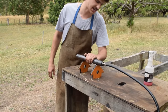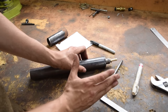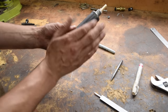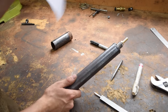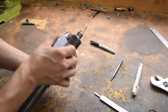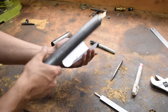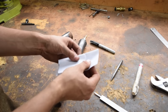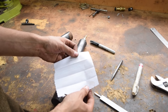At the drill press, we've got a mark at 30mm and we want four or five holes around that center mark, all perpendicular and square to the pipe with even spacing. Rather than just measuring it out, I'm going to get a bit of paper and line it up — I've already cut it to the circumference of the pipe. We fold that paper in half, then in half again, giving us four even creases to mark the hole positions.